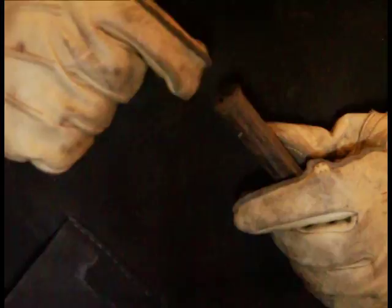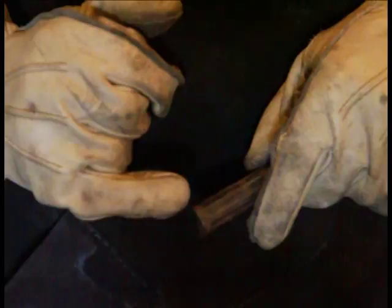What has happened is, through repeated use, the top of the chisel has begun to swell down and mushroom out. What this results in is work hardening and eventually a fracturing of the material, which will eventually result in a chip flying off and injuring someone in the eye or in some other way.